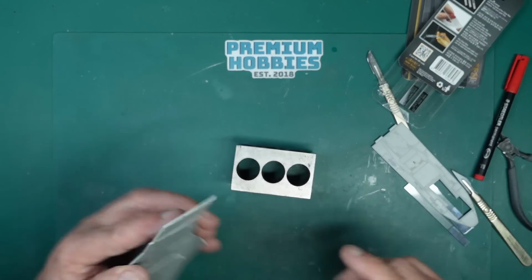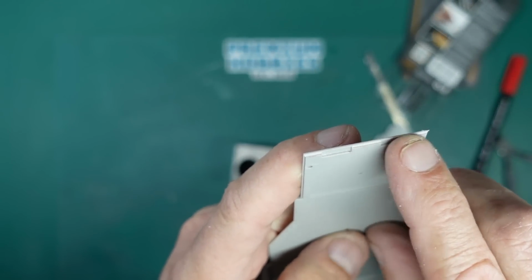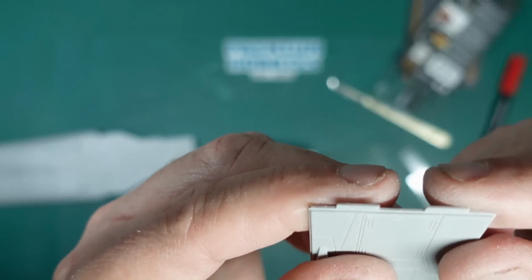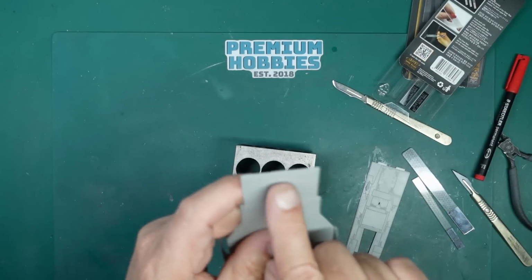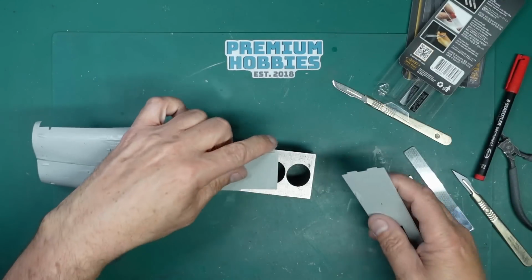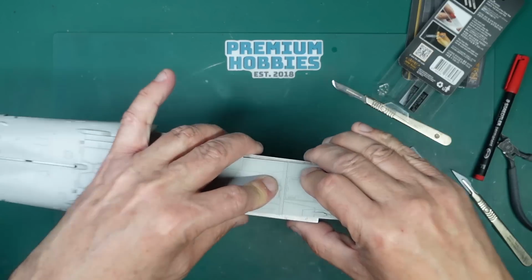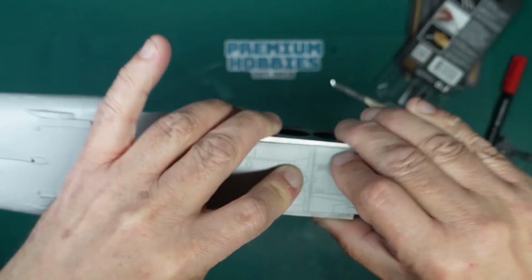Right, so there we go. So by removing material from this ledge in here, from these three faces where I put the red ink earlier on, and by removing a slight amount of material from this end face on here, not the outer face here, and not this edge here, okay, only the internal bits, and by doing that we have now got it so we could get a perfect seam. Okay, you can see it's gone together there, and it's lovely, even if I do say so myself.